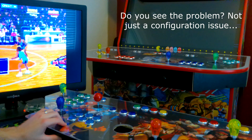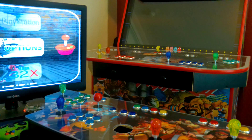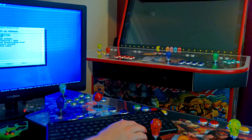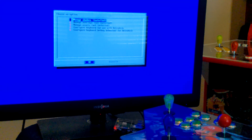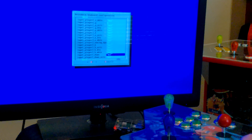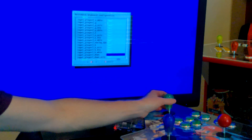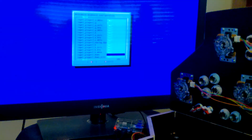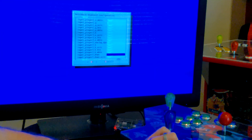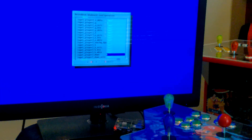I'm going to go to the configuration menu. Back into the main menu, Options, RetroPie Setup, down to Configuration Tools, RetroArch, Configure Keyboard — because it thinks the iPAC4 is a keyboard. Player 3 down — press Delete. I'm going to move down on the joystick, hopefully it detects it if I plugged it in correctly on the iPAC4. I don't think I plugged the iPAC4 back in — that's the problem. Nope, I didn't plug the iPAC4 back in. There we go — should probably detect something now.